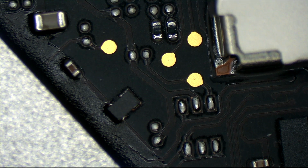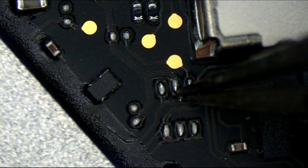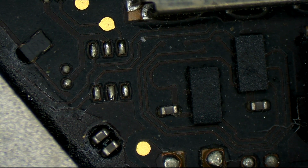Yeah, the Wi-Fi module is built in. So this is the Wi-Fi proximity sensor right here. Take a look. Look it up. This is it. U5820. That's a good sensor. That's very sensitive. Let's see what the donor board looks like. What machine? 820-00239, 13-inch touch bar. No.